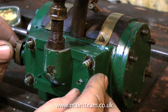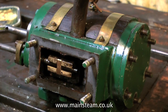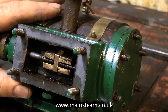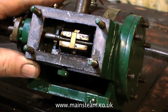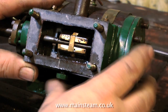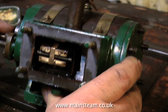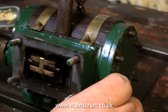Time now to have a look in the steam chest. I've removed the bolts and I'm now taking off the steam chest cover to have a look at the valve — and it looks OK. The port face doesn't look scored and the valve looks to be in quite good condition. The slide valve was not really an issue with this engine. The main part of the cylinder that needed looking at was the piston, because most of the compressed air was passing the piston. So when I make the piston fit to the cylinder and work without passing air or steam, this engine should be quite efficient.